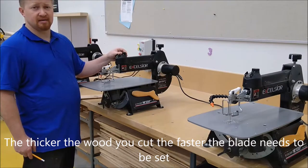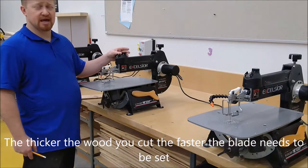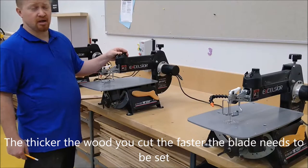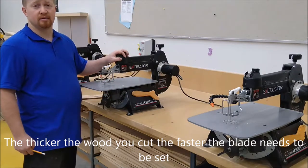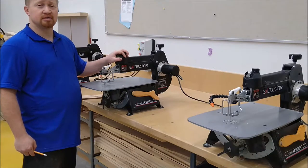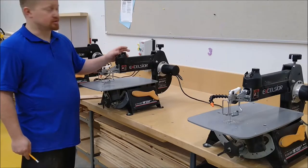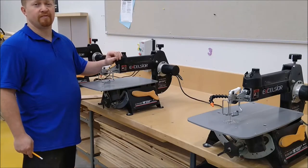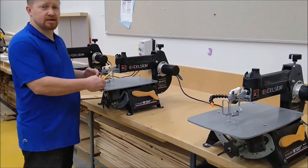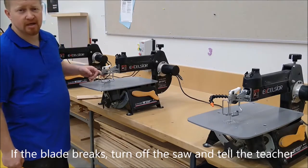What happens is that students get impatient and scared at the same time. Because they're scared, they turn the speed down as slow as they can, but because they're impatient, they push the material through as fast as they can — causing the blade to not be able to eat away at the material fast enough, making the material jam, start vibrating, and creating potential danger hazards. Never have the speed less than half when feeding material through — take your time.